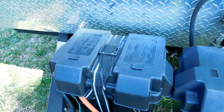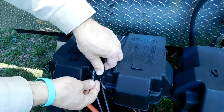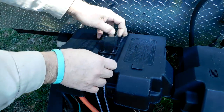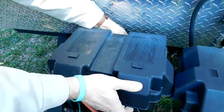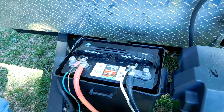The first step in preparing to check the specific gravity on your battery will be to gain access to the top side of the battery. Either remove the battery box cover, or take the battery out of wherever it happens to be stored, because you will need about a foot of clearance above the battery in order to use the hydrometer.